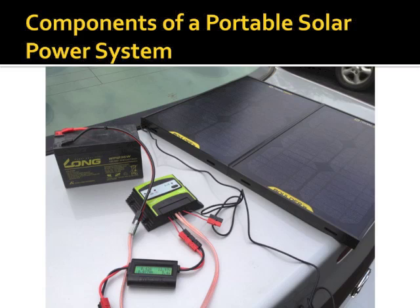The little neon green box is a solar charge controller, which is what is actually interfacing between a panel array and the battery. I got a couple of solar panels. In this, I also have a meter measuring the performance of the solar panel. Now, one thing you might notice, it's completely cloudy. That's a 30-watt panel array, and I don't know if you can see this, but I'm still getting almost half an amp out of it, and 5.4 watts, so 1/6 efficiency under completely clouded over skies late in the afternoon.